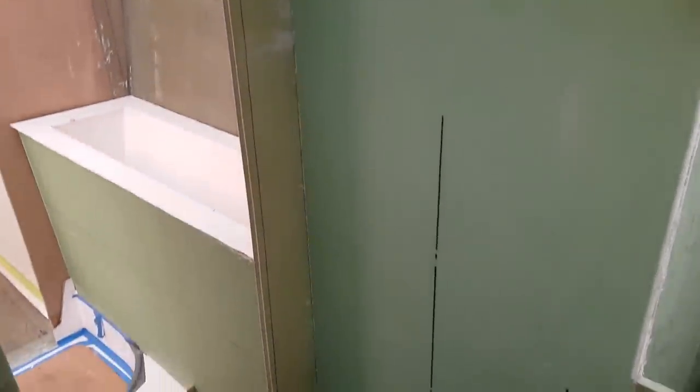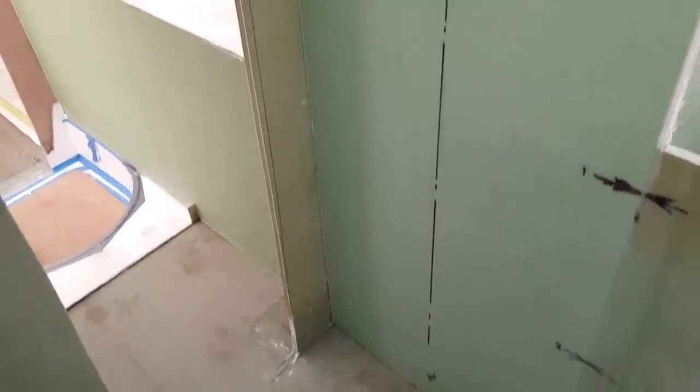Now, next thing is to work out the wardrobe height here, and I'm going to remove this panel. And I'm going to cut out these wardrobes, and basically the insert is going to form part of the foam core doors. So I'm just determining the center line of the wardrobe here. Halfway point is 305 mils. So I've just drawn a center line, and then I'm going to determine the wardrobe size.